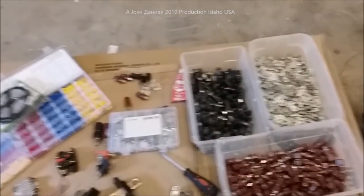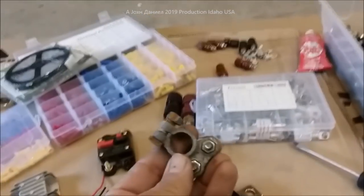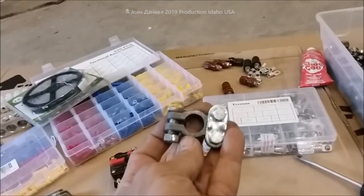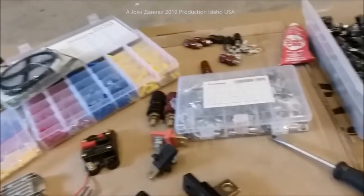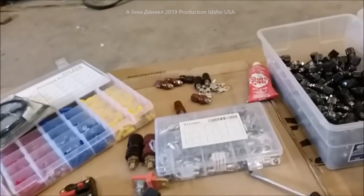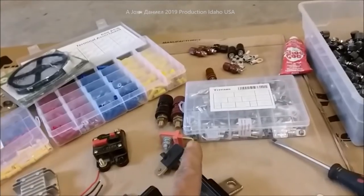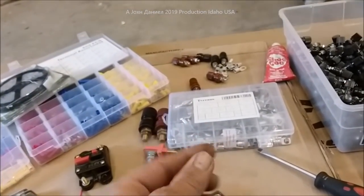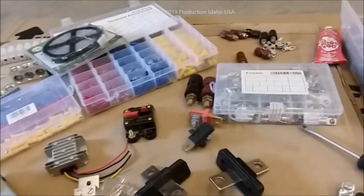When working with DC voltage, start with a basic premise: DC voltage is a major issue that requires serious attention to clamping force — like your car battery terminal clamping force. Keep that in mind throughout this video. When you do DC voltage, you use a crimper to crimp the wires, not a wire nut — unless it's very low voltage, very light amperage yard lighting. Even those screw-on outdoor terminals have a different type of spring with water seals; they're not a regular wire nut.